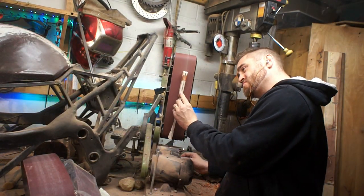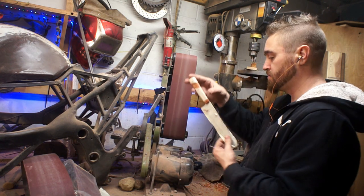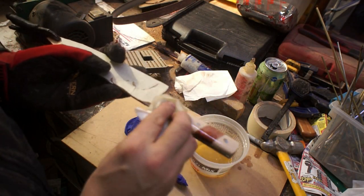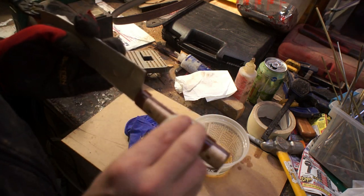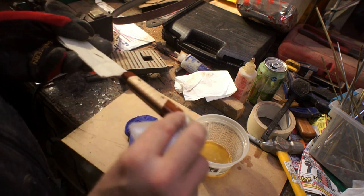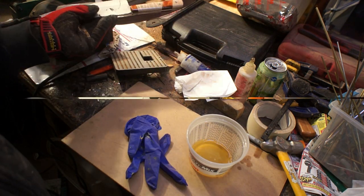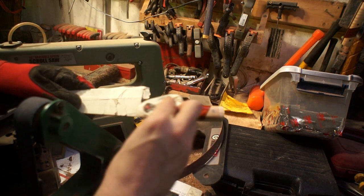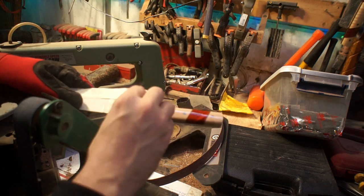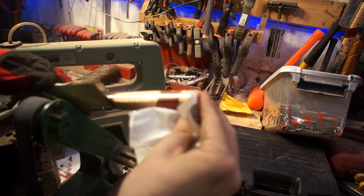This is what I was trying to avoid when I made those scales the right size, but I just couldn't get the fitment quite right, so I came back and ended up having to grind the back of the knife down a little bit to make them exactly flush. I was coming up on my Christmas deadline — this was actually a couple nights before — so I needed a finish that was going to work on the first time. Whenever I need that I always go to a wipe-on poly. The film thickness isn't really thick, but since these are going to be chef's knives getting wet and getting water on them, I wanted something that had a physical barrier between the user and the wood. I sanded between coats with a high grit sandpaper and did about three or four coats.